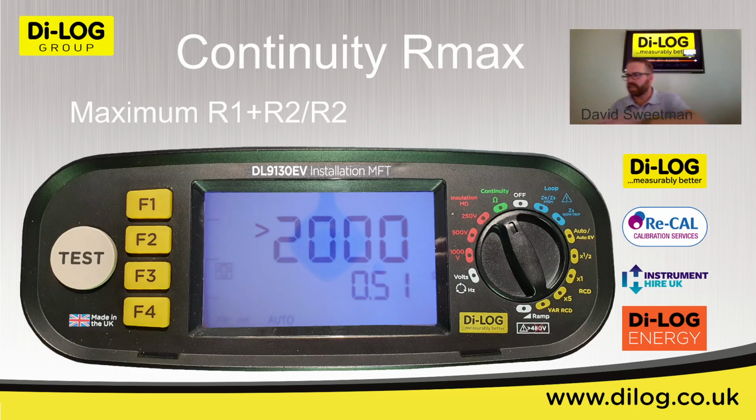But something new we've actually done with the tester is introduced a system called RMAX, which is very, very similar to ZMAX, which will automatically capture the maximum R1 plus R2 resistance or R2 resistance as well. So this is when, for example, doing a ring final where you've looped out your live and earth at the distribution board, obviously once it's safely isolated, of course, and hopefully it'll be a new installation as well. So the idea is that you can check polarity across all your sockets and you record the maximum R1 plus R2. And this is quite important for the Zs calculation, because we all know that Ze plus R1 plus R2 equals Zs. So it's very important that you know what this is, one, to record in your EICR reports, and to have an idea of what your earth fault loop impedance should be at the end of it as well. So RMAX will, like ZMAX, track the maximum continuity.